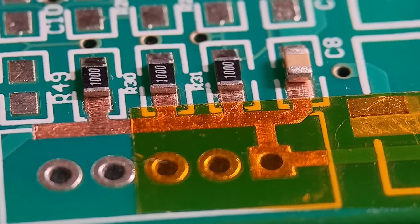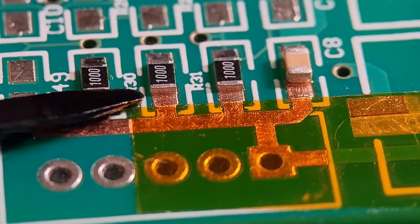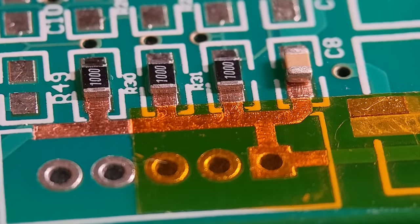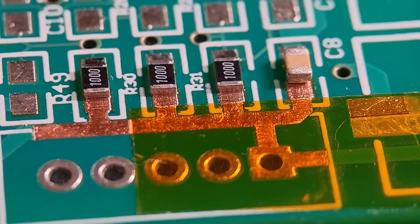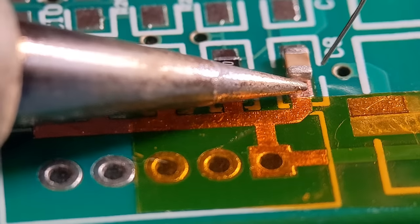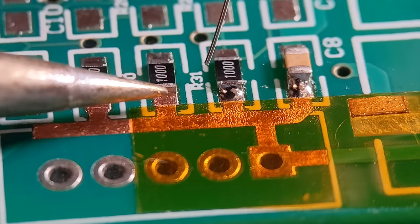First of all, I'm just going to add some flux along the front, as I always do when soldering. Just want to get a bead of flux right along all the joints. Now the way I always do my components is tack them onto one end, do the second end properly, and then revisit the other end. For this one, I'm just going to do this end properly and you'll see the results. I'll get a slight bit of solder on my iron and then we're going to do the joints. And you'll see the solder stop at the tape — no matter how long you hold it on there, it will protect it.